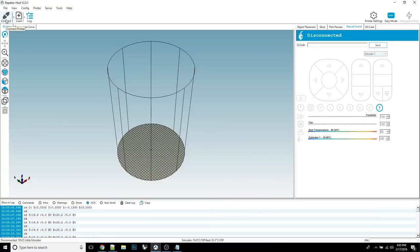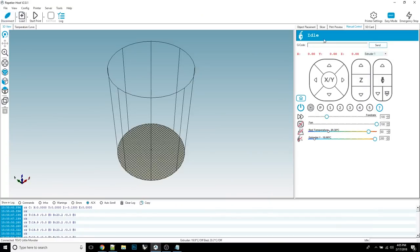it in. Come back here to Repetier-Host and connect to the printer. And now we want to issue a reset command, and that is just R-E-S-E-T, enter. Okay, actually let's caps lock and try that again, RESET. I don't know if it needs to be capitalized on that one, but just for safety's sake, let's do it like that. Okay, so now I should be able to go G28